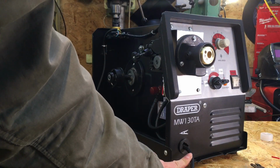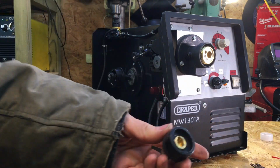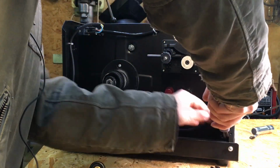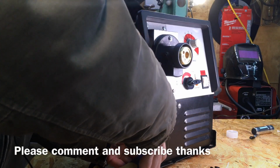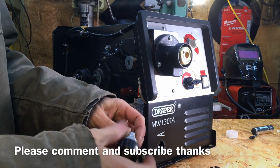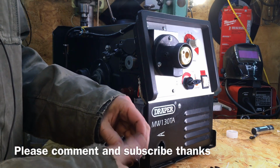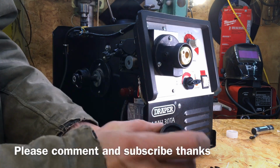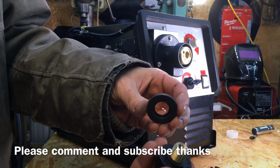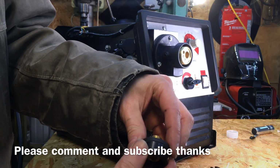Right, so the return or earth cable down here, what I'm going to do to this is remove this cable and crop it off, and I'm going to install this DINSE connector here. So that's out, and the DINSE connector should be just the right size hopefully. So you've obviously got to make sure that this connection doesn't touch the case, so make sure you put it together properly. It goes through the panel like that, and this sandwiches on the other side.